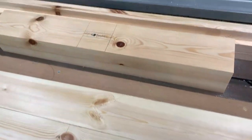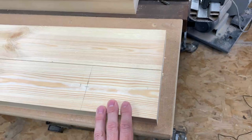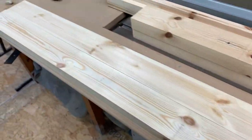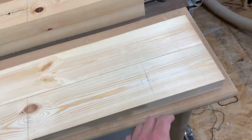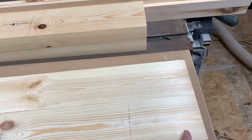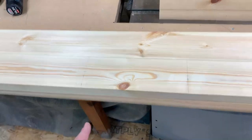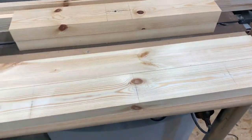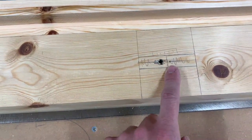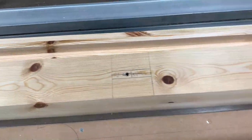I've already marked out one of the legs and one of the feet to get a head start on the video. I decided how much the side piece was going to be mortised into the foot — about 20mm, so half the depth of the foot. I marked the top and bottom bar positions: the bottom dowel is about 150mm up from the floor and the top one is at about 1100mm. I then divided that into equal spaces for five bars. On the top of the legs I'll knock off the corners, and on the feet I've marked out the centre and where the mortises will go.